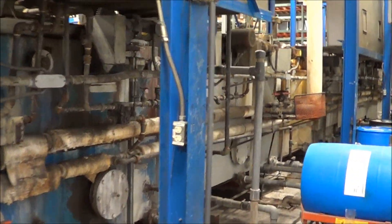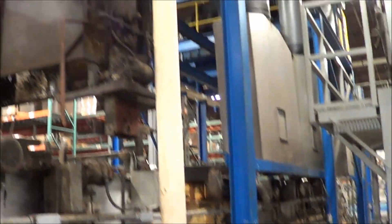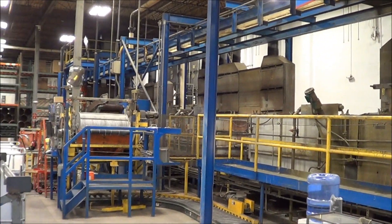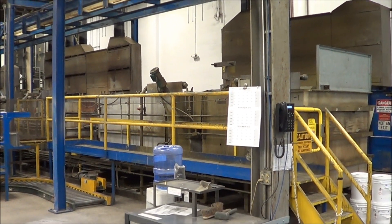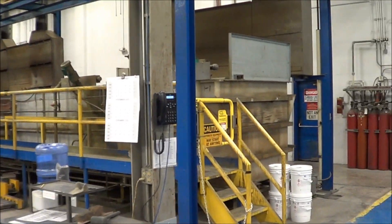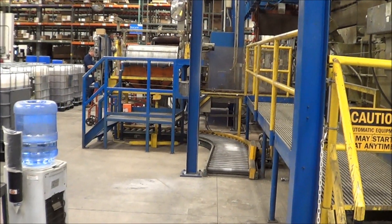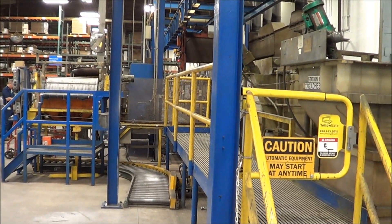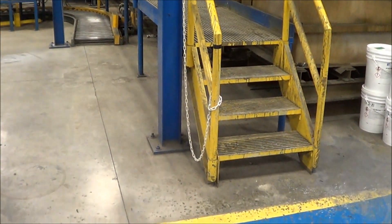The back side of the line is in great condition. The overall dimensions of this NAPCO 20-station phosphate line are 93 feet long, 13 feet 4 inches wide to the outside of the two I-beams, and 22 feet 8 inches wide in the same configuration including the load section. It is 159 inches tall from the floor to the top of the superstructure.